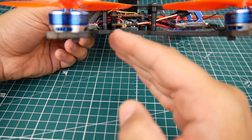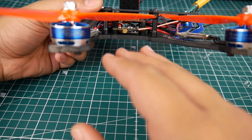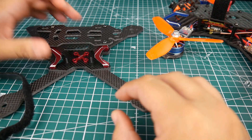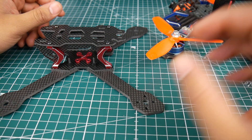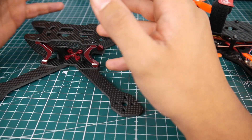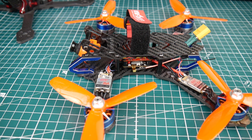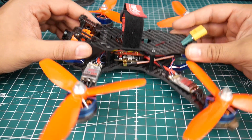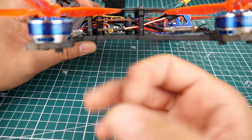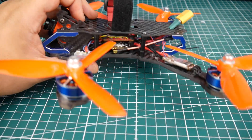Overall it's a very, very nice and beautiful build in my opinion. I love the internal components of this quad so much that I'm going to be using these internals as my frame testing setup, because it's going to be very easy to swap out. For example, we have that new DALRC frame right here. I'm going to rip the internals off this quad, put them in the DALRC, test out the frame, report back to you guys, and then we could build it with something else. From now on these internals are going to be my frame testing components because they seem absolutely reliable and premium. If you're the type of person who doesn't like all-in-one flight controllers, go ahead and pick this up. If you don't want individual ESCs, just get a 4-in-1 ESC and you have a 3-stack that has everything built in — all you need is motors, a camera, and you're done.